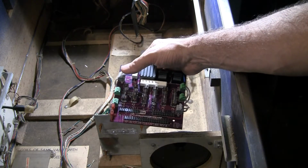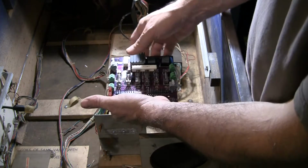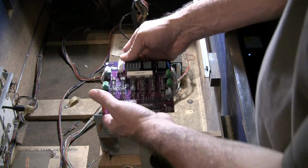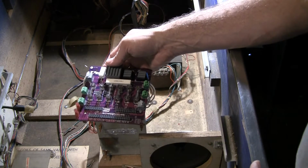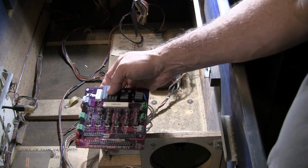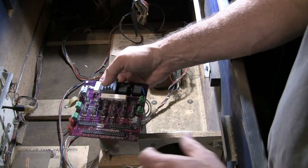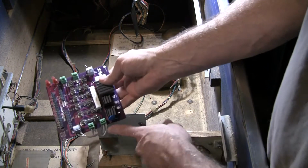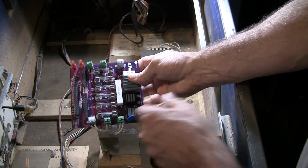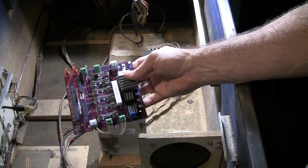I would have used screw terminals. Screw terminals make a lot more sense. You put them in here, and then you have a little screwdriver, and you torque them down that way, and it's in there. So I gotta say, if the guys that are doing this are listening, do another revision of this and get rid of these push terminals. There's no great advantage. They're hard to use, and if you look, the build quality is kind of poor. Look at this terminal, it's actually janked a little bit to the side. So the build quality on these things is less than ideal.